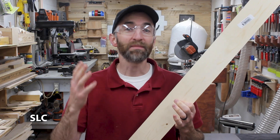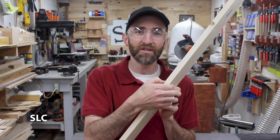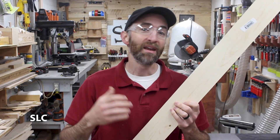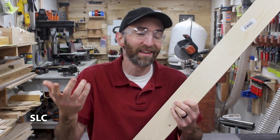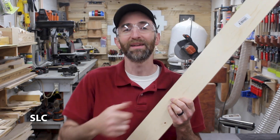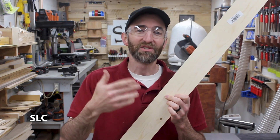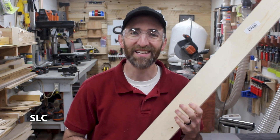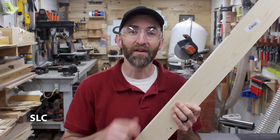I did some measurements and I wanted to get at least 4 feet tall, but I'm a little bit shy on the full width — it's going to be closer to about 7.5 feet. Not perfect, but close. I did the ratio on that and it actually comes out very close to the 1.9 just by luck. So with that said, let's get started on the cleats. For the cleats I'm going to be using a 1x4x8, because the dimensions come out right at three quarters and that's what I like. It's right at 3.5 — it should be a little bit higher but again, not government issue — this is for my workshop. You can build it however you like. So let's go cut these at 45 degrees.